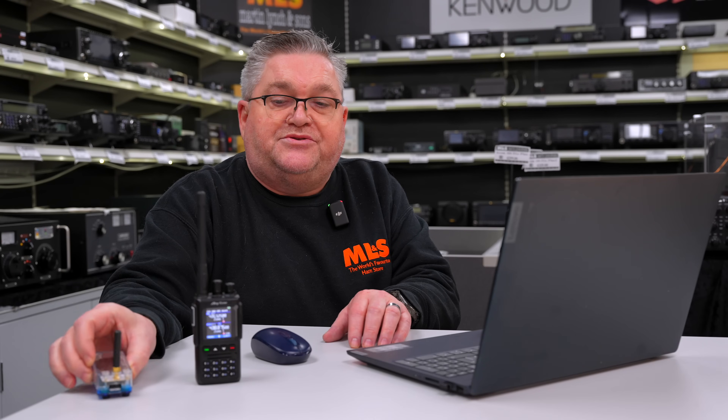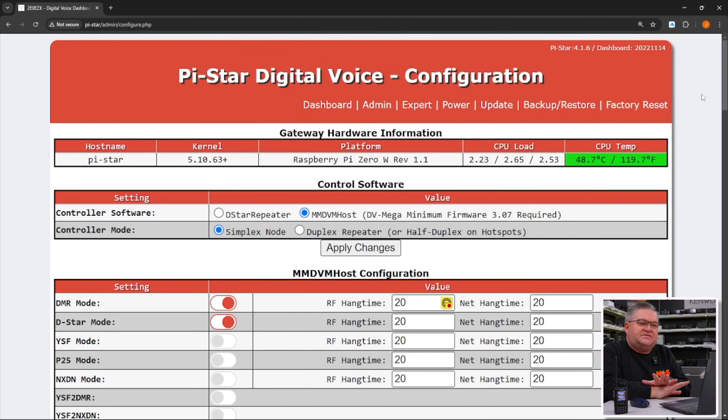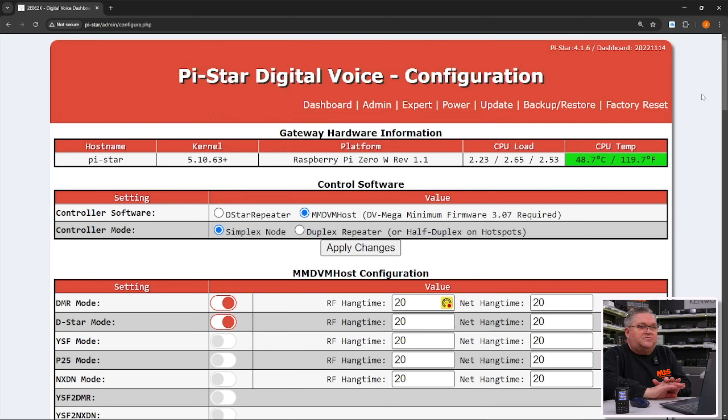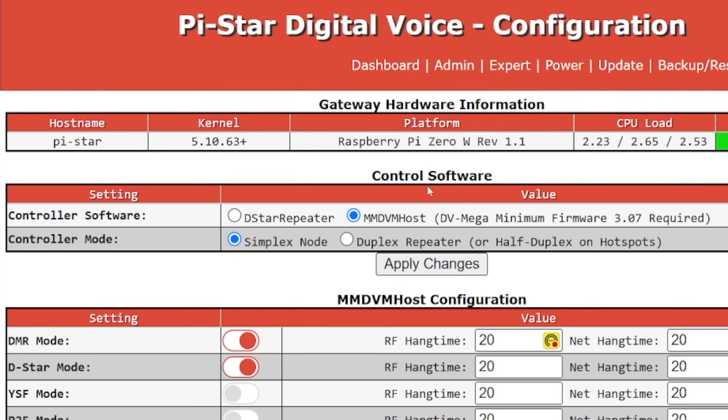Thank you David. My name is John Power, I work in the Sounders team. My call sign is 2E0EZK. David's obviously giving you an overview of the 168. I'm going to go through the Pi-Star configuration and how that Pi-Star on the ZumSpot will allow you to communicate from the 168 to the ZumSpot, enabling you to talk to people in the UK and all over the world. So this is the Pi-Star platform — Pi-Star is its own standalone operating system and this will enable you to connect to the ZumSpot and for the handheld to connect to the ZumSpot and obviously connect to the DMR network. I'm not going to go through how to connect the 168 to the ZumSpot — there are videos on our channel already covering Fusion and D-Star.